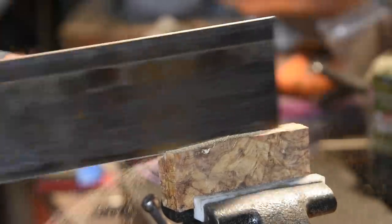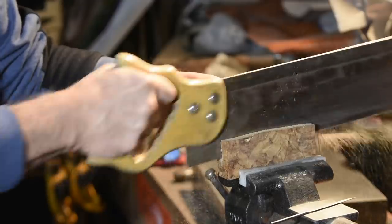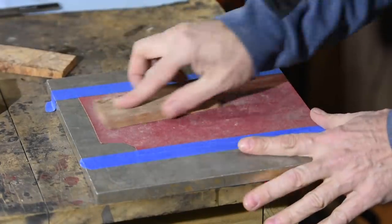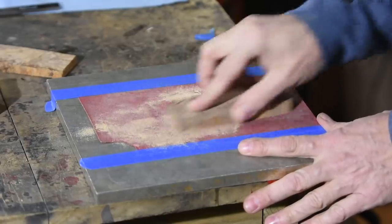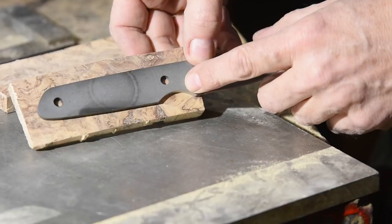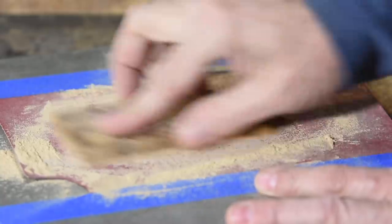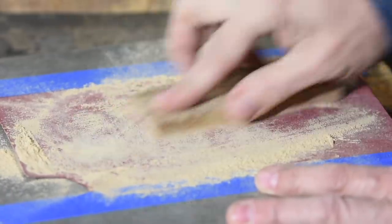I'll begin by splitting the wood. Now I have all kinds of fancy tools — if you do too, I encourage you to use them to save time — but if all you have is an old handsaw, not a problem. If you want to use a man-made material like micarta, just skip this step. Now we've split our blank into two scales. I did a crap job of sawing these, but even if I hadn't we'd still need to flatten them. I'll do this by taping sandpaper to a flat surface and going at it until it's flat. You want these to lie absolutely dead flat to the tangs with no gaps. You can use sandpaper in the 60 to 120 grit range, or even start with 40 if you want.